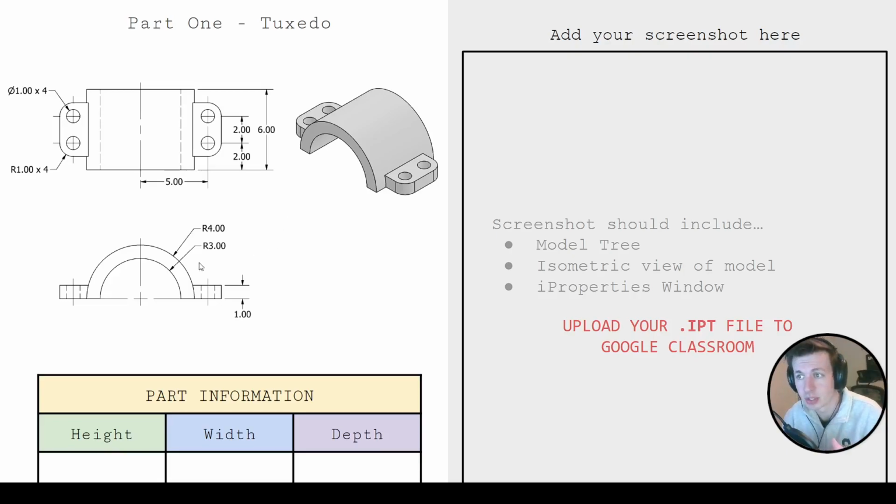So when I'm looking at this front face, I see the dimensions of 3 and 4 for my radiuses. Those dimensions typically mean that I want to use those when drawing this face. So if I'm starting with drawing this front face, which I am, I'm going to be using these dimensions. This little height for these nubs is going to come in later, but these are the ones that I'm going to start with. So I'm going to use these in my front face when I start drawing.